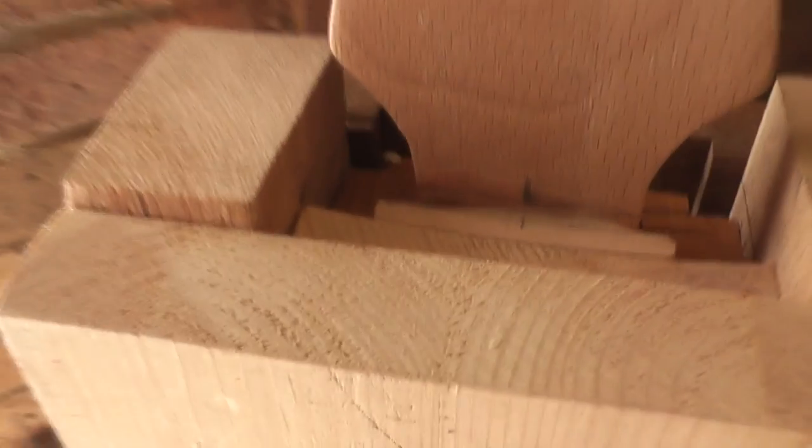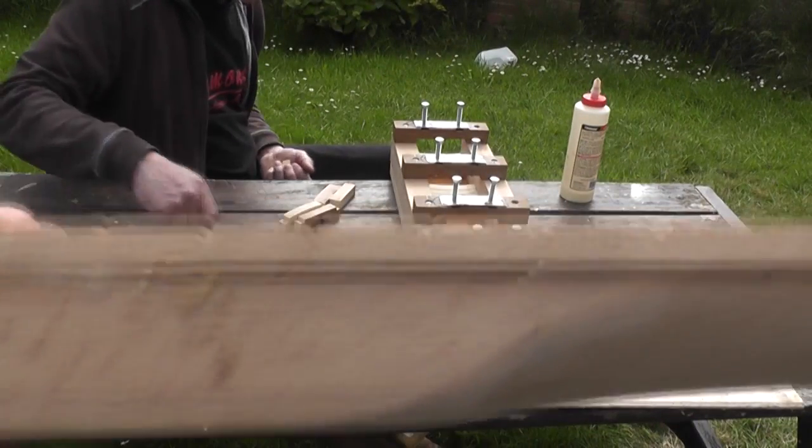On top of the neck, you can see that where this box was made for flat necks before they've been sanded, we had to make these curved wooden inserts to use for this one-off job. With the bolts hand tightened, we checked the centre line. This is wrong, we actually adjusted it after, of course, and once it was lined up properly, we clamped it down with a spanner. And after all that, I still have a gap between my neck and fretboard.